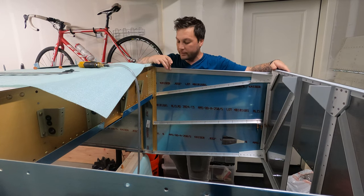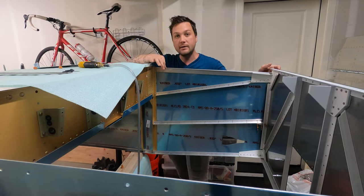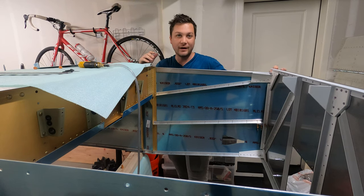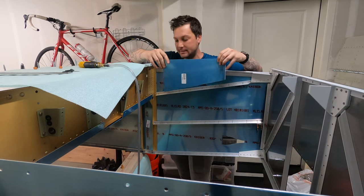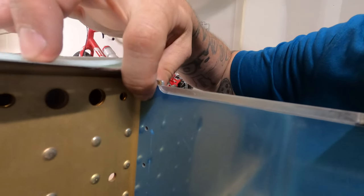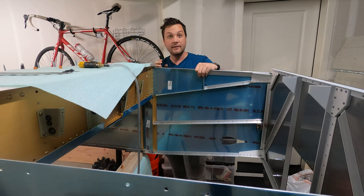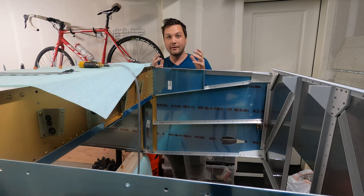So the last part of this was determining whether or not the little remnant of this leg of the angle that existed after I removed it needed to be filed down to the same level of this or not. And I feel like I owe Vans a little bit of gratitude here, because I've been pretty harsh on them, and I was excited to see I had a little cutout here that's the exact size needed to make room if you didn't get that flange cut exactly flush. Like I didn't. So all I had to do was slightly radius the remnant of that flange, and this, once again, fits perfect. In fact, leaving a little bit of that helps everything kind of nestle into place. I'm very happy with it. All that's left to do is everything all over again for the second side.